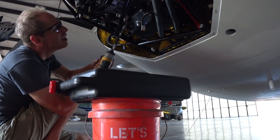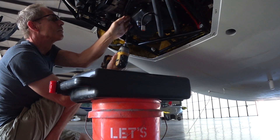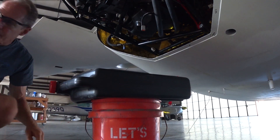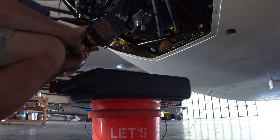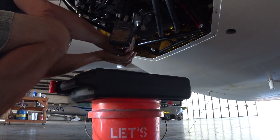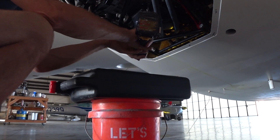I wanted to do this all along but I couldn't see a way of doing it with this existing housing without putting some sort of feed in that would use the engine's oil supply. But once Mark pointed out that we didn't really need a full-on feed, it was obvious we could use this housing — we just needed to patch up the other holes and sort out a drain that was higher up so we'd have a constant level of oil in the bottom. I feel much better about this solution even though it means more work, but in the long run when you get in the aircraft and know you've got a single oil feed in there and a single return, that's the right way to do it.